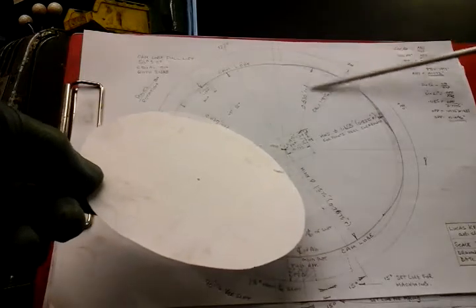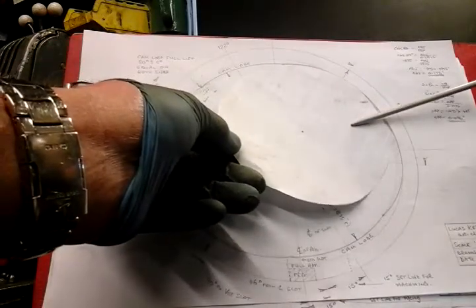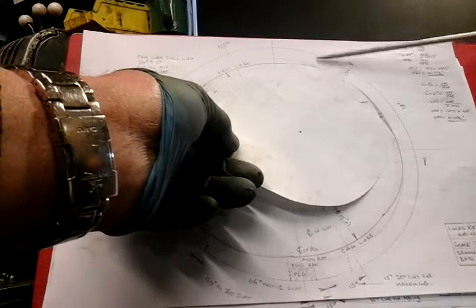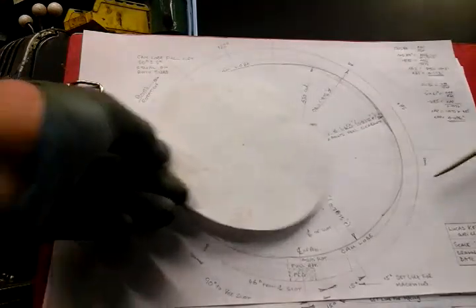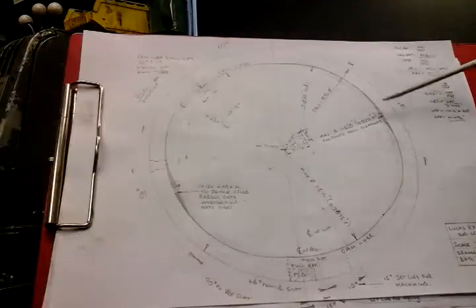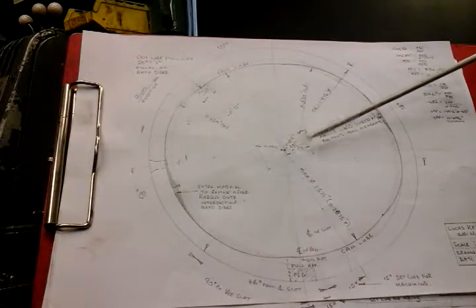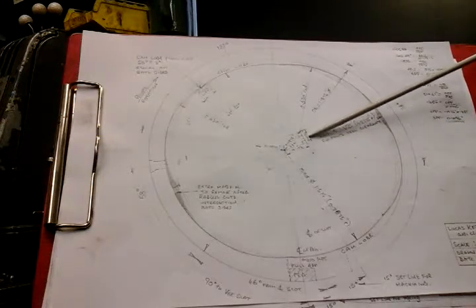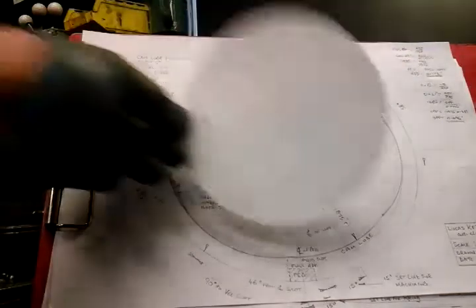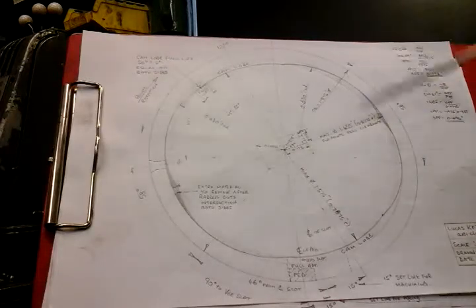I'll cut four cuts in this ring, taking that material out, then move over on my coordinates and take this side out, and so on at four points. That leaves a little bit of material in the middle. All you have to do is bring your spindle back to centre and instead of using these coordinates of 0.96 and 0.173, use the radius size 0.1975 to move over and mill that centre bit out on both sides. I'll just take you over to the milling machine now.